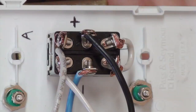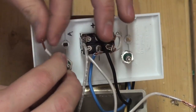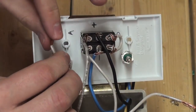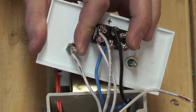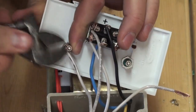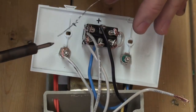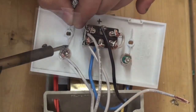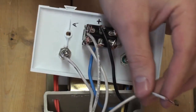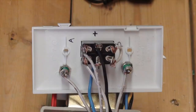Take the remaining electrical wires that are spliced to the blue-black positive lead and the yellow-white neutral lead and attach them to either of the panel mount banana jacks. It doesn't matter which side the wires are attached. Wrap the electrical wires around the terminal but between the 2 hex nuts and secure tightly. Using a bit of solder, secure the electrical wire to the hex nut and the terminal. Simply repeat this process for the remaining electrical wire and banana jack. Here is the final product, which is ready for placement into the electrical box.